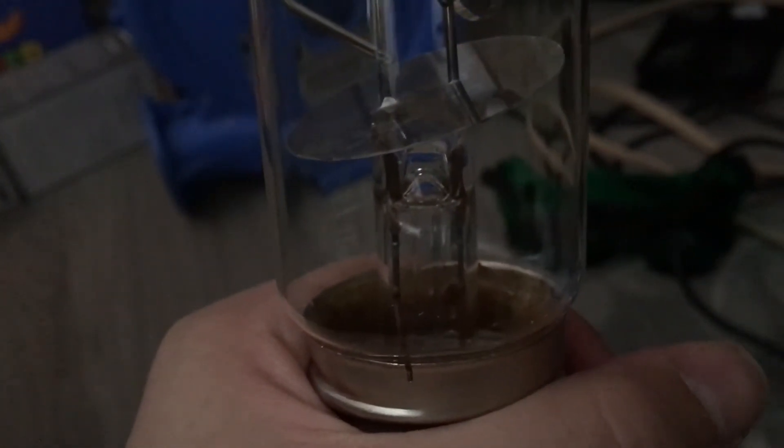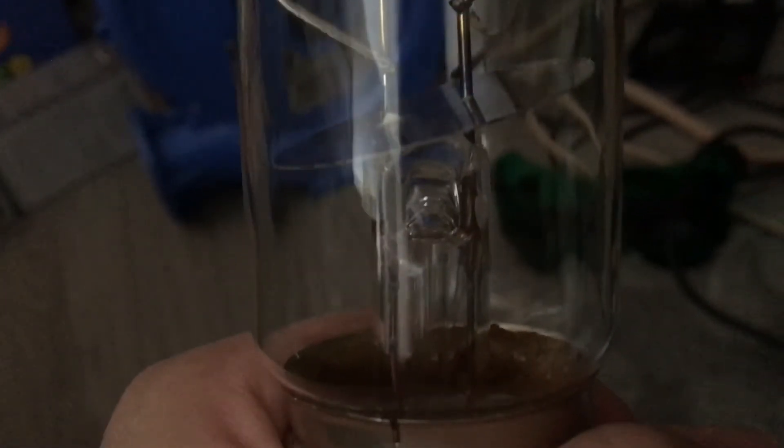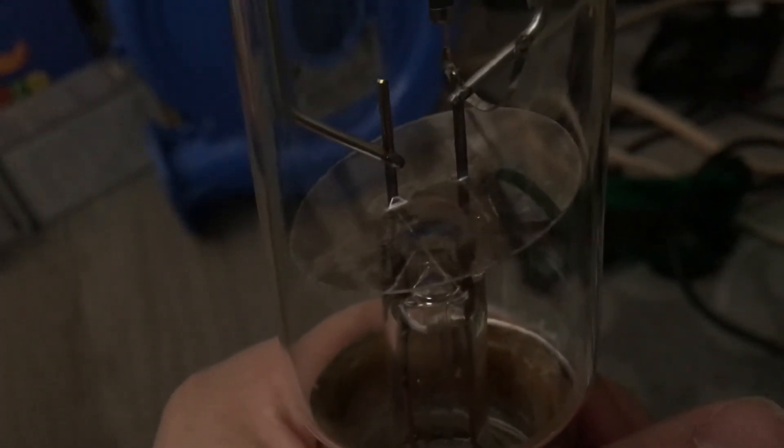Now that we're done with the etch, let's look at the construction of this 10,000K metal halide lamp, starting from the bottom and going to the top. You can see some bulb glue right here supporting the base, and a very nice hard aluminum base with a ceramic insulator, which is rough. We have our stem right here, and also a heat shield here to prevent heat from going all the way around the lamp, and wires that connect to the arc tube.